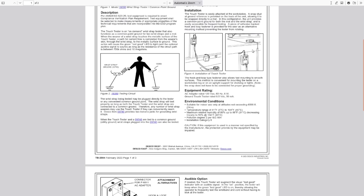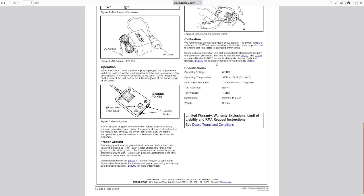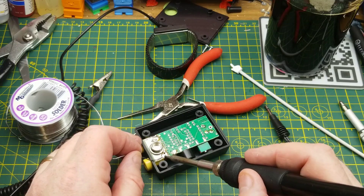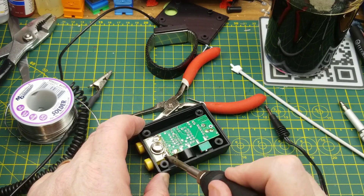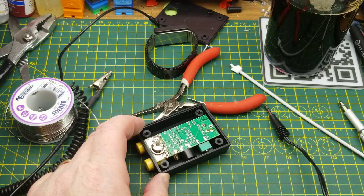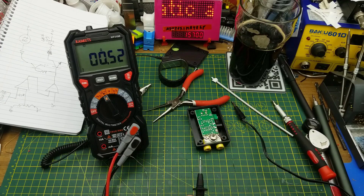You can test either to the device itself or across a proper ground. Some installation scenarios show a workbench setting — use the grounded snap or the banana jacks, either one works. There's the little switch to turn the beeper on and off. The circuitry inside is not what you're paying the hundred-and-whatever dollars for — you're paying for calibration to traceable standards, which you need for lab-grade work. Just for the hell of it, I'm going to put this back together and see if it works. Maybe I bumped something loose and my hack soldering fixed it. I've got good continuity between the connections and circuit ground, so that ought to do it.